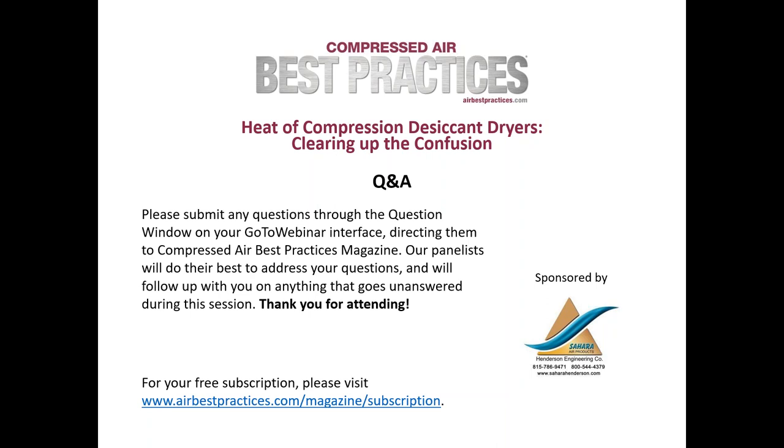Now, actually, one of the hidden benefits with heat of compression is that you don't have a coalescing pre-filter. Even if you have an oil-free compressor and you buy a heatless, a heated, a blower purge dryer, you're going to have a coalescing pre-filter ahead of the dryer just to protect the dryer from liquid water carryover from the aftercooler. Right? Even if there's no oil, you still have a pre-filter. And that pre-filter builds a pressure drop and you have to change those cartridges typically 6 to 9 months.